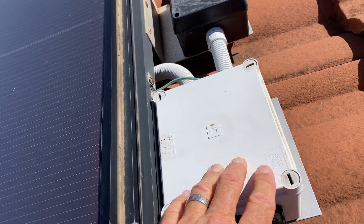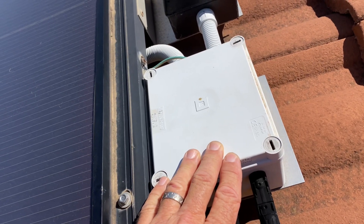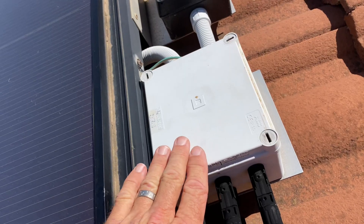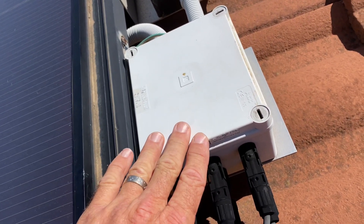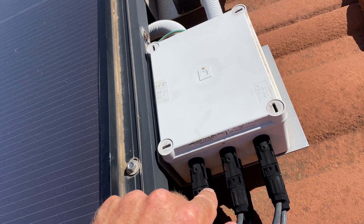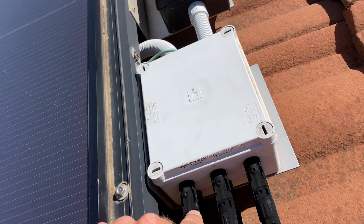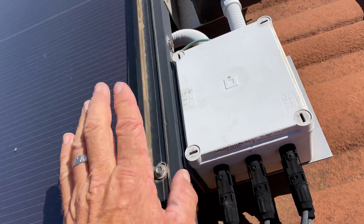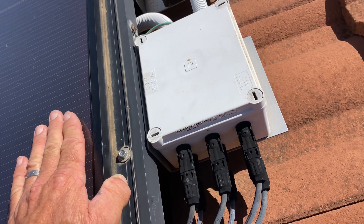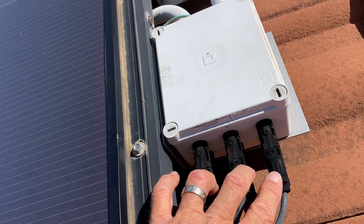I've tested for faults, which can be quite confusing when you've got a negative earth grounding kit installed, so it's important to isolate that first when doing any testing. I didn't come up with any faults — the fuses were simply blown. The fuses were quite close to the actual output of the panel. When you parallel solar panels, fault currents can get quite high because they can combine and increase the voltage and current, creating hazardous situations and damaging panels if you exceed their voltage or current limits. It's important to fuse strings when paralleling if you're exceeding their limitations on the type label.